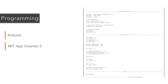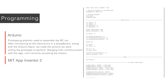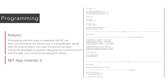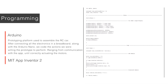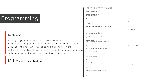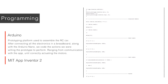Programming. The first section of the code starts by importing several libraries, defining instances, constants, and the pins to which the different electric components will be connected. The setup section is executed only once, where the mode of operation of each pin, baud rate, and several instances are initialized. By definition, while Arduino is active, the loop is continuously executed — GPS and Bluetooth implementations are contained by this function. The GPS is in standby mode waiting for location values and ready to immediately send them to the app, while the Bluetooth puts the Arduino reading for new values coming from its serial port, connected to the car app.